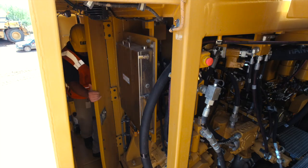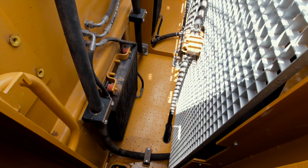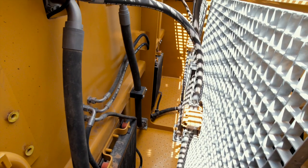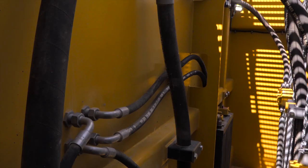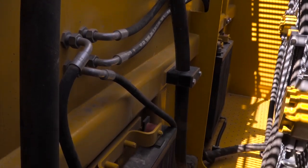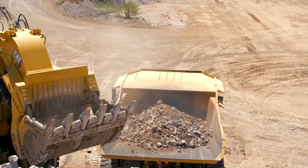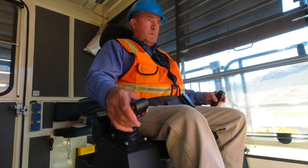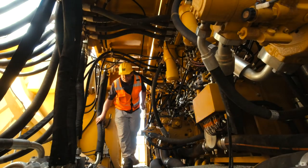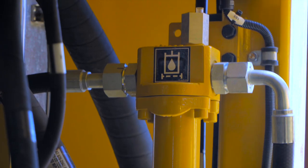Moving past the second engine back to the front of the machine again, we can find the oil cooling module. If you take a look inside, you can see that it has two large independent coolers. What's special about this system is that the oil cooling is independent from the high pressure hydraulic system, allowing for immediate cooling capacity as soon as the engines are running, even during idle. This is achieved with dedicated oil cooling pumps, which provide a constant flow from the hydraulic tank to the coolers so that the system can maintain an optimal oil temperature, providing increased uptime. In addition to optimal oil temperature throughout the duty cycle, the hydraulic components also benefit from continuous hydraulic oil filtration.